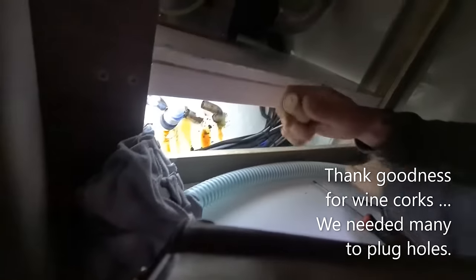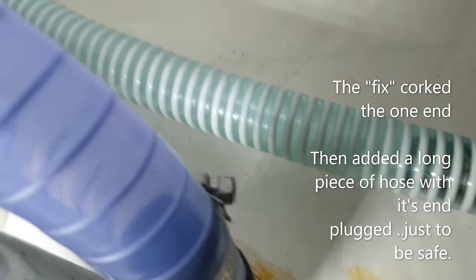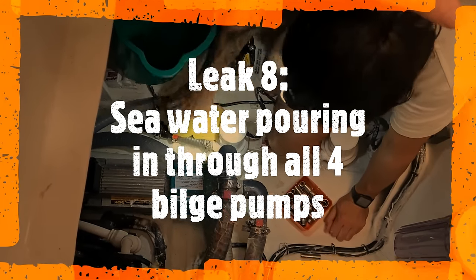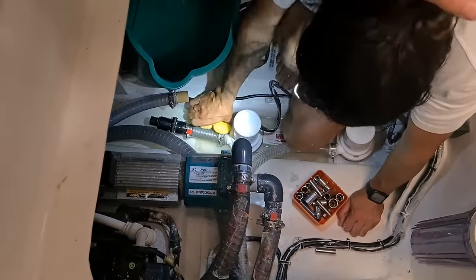Garen reckons the cork will go inside and a pipe will go on the outside to stem the flow of water from this third diesel heater that's overflowing so badly. We'll harden it so it can be hammered in. Also, water is coming in through the skin fitting that is the outlet for the bilge pumps and slowly draining in.